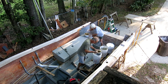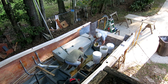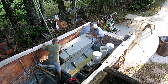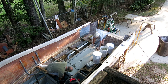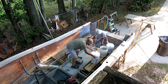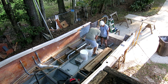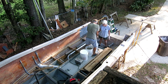Using the chart that came with the foam showing expansion ratios and doing the math, I figured I needed a full gallon of foam underneath the tank in the middle part. So we split it up - Debbie's mixing a half gallon, I'm mixing a half gallon. You've got like 15 to 20 seconds before it starts reacting and foaming up, so you've got to mix it really fast and get it where you want it. You pour the approximate amount of liquid under the tank, set the tank real quick, then weight it because it will float up. I've got four five-gallon buckets of liquid on top plus a battery and me.